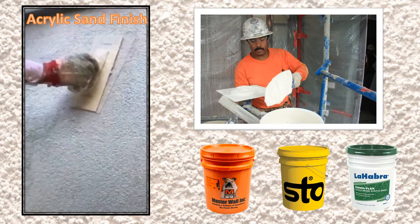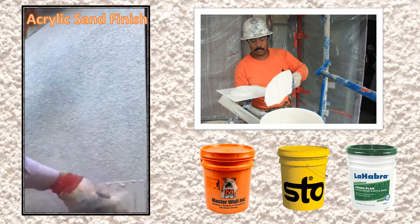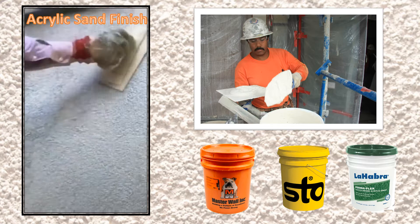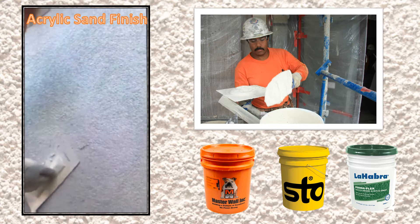Sand finish texture is very common with acrylic finish products. Acrylics can use color vials or come pre-blended in the pail. Application is with a steel trowel, applied as a thin tight coat over a cement base coat. A primer will help with coverage and workability. Unlike cement finishes that use a sponge float, acrylic finishes use a hard plastic float with similar motion and pressure. However, you're not bringing out the sand but rather getting it to align and roll into place. A sand finish with acrylic is easier to achieve than with cement, and the color will be more uniform.